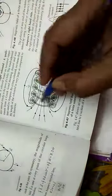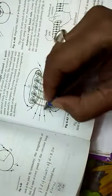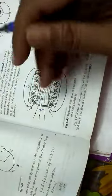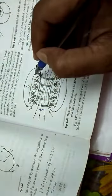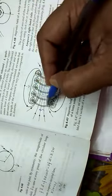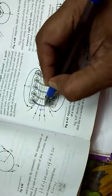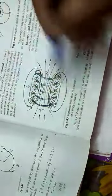Here you can see half of the solenoid, and the magnetic lines of force are going inside the solenoid. So this end has to be the south pole and this has to be the north pole, as done in the earlier video. If you consider a turn and another turn with current coming out, half of the solenoid is above the paper and half is below the paper, which is not shown here.